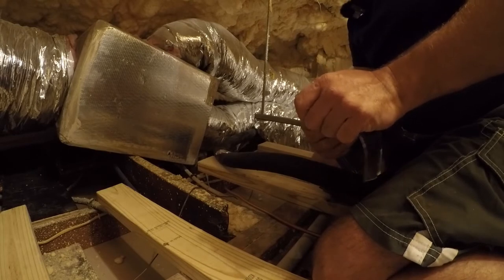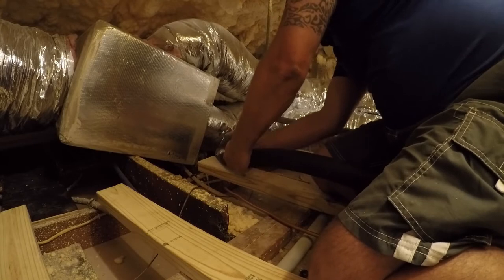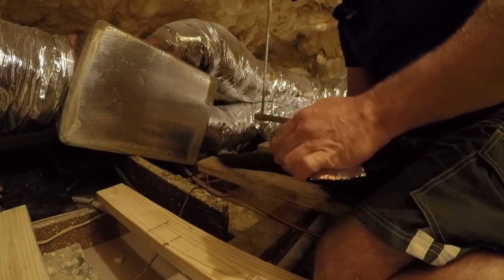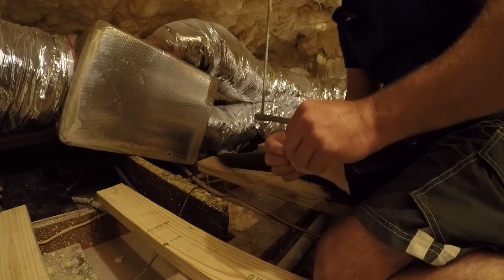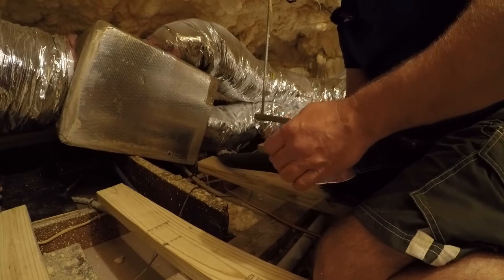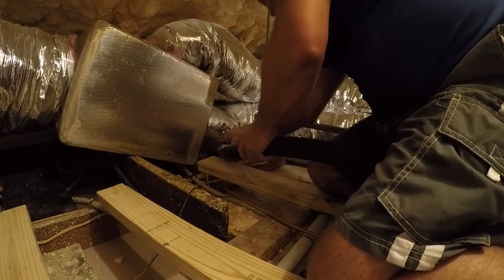So in the previous system, I had it go up over the system, and that wastes some small amount of electricity. So I'm going to take that 3 feet of head out of the system. And, you know, there's probably somebody out there that'll go, that doesn't matter. Well, actually, it does. The compressor is still a pump, and it still has to push the liquid up. And you lose flow when you go up, and that requires more energy.